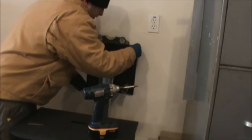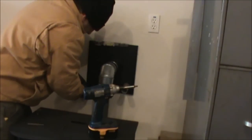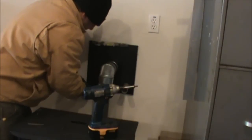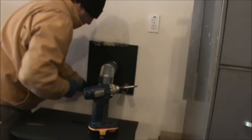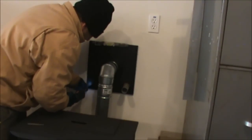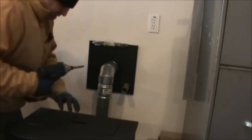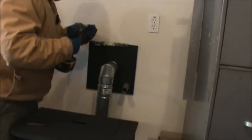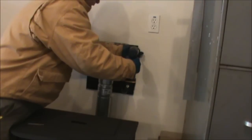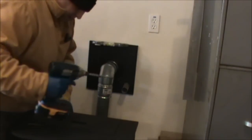The hole on the metal is tight, but when I drilled through the plywood I left it oversized almost a half inch. I'm using drywall screws — I could always put wall anchors in later. These seem to be biting pretty well. This is fire-rated drywall, so it's five-eighths of an inch thick.